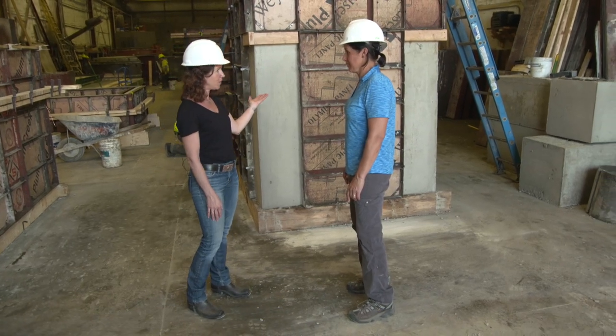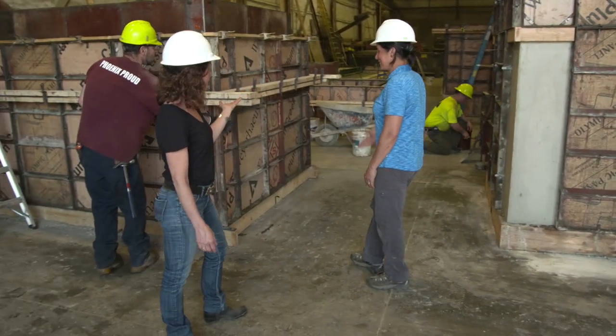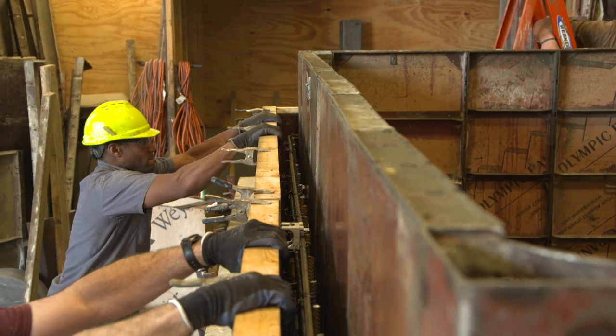You can see they're making a pump vault. They make septic tanks. That is very efficient. And this is our pour right here. We've given them all the dimensions for the pool. We're going to have a four-inch wall. The rebar is in between those two panels. We have given them all the locations of the pipe for the plumbing, and they'll be pouring the concrete right in there.